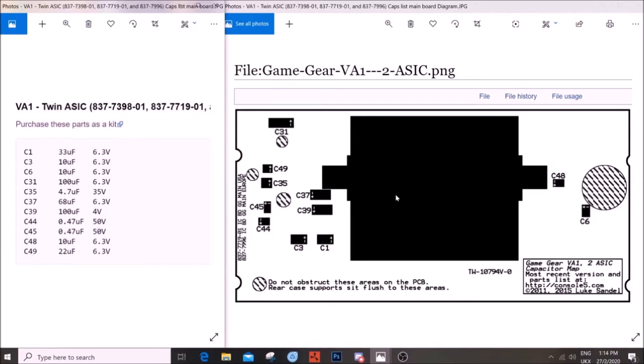Remember to test fit with your case, and as you move on, you should be able to progress nicely. Of course, if you have any issues, I would always suggest desoldering it, maybe use another one if you cut the legs too short, or perhaps trim the legs down a little bit, maybe fold them over a bit more. Just see how your case fits in accordance to the capacitor that you managed to get.